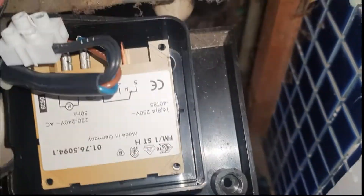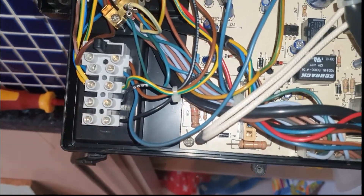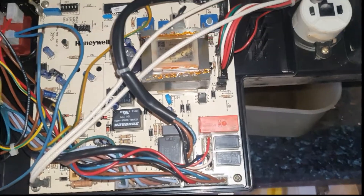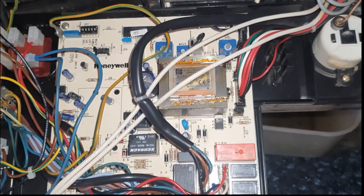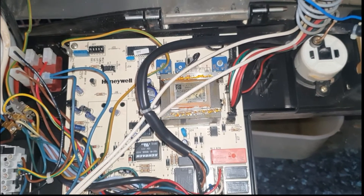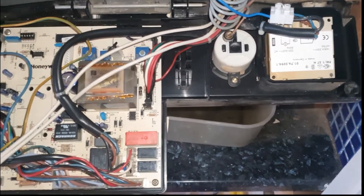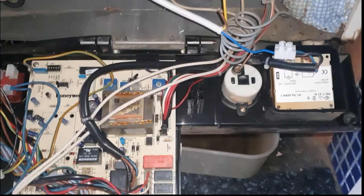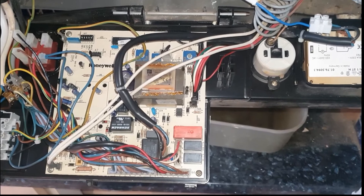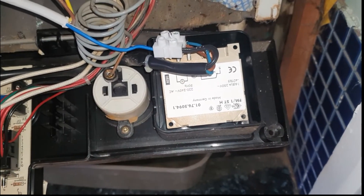Here's a clear picture of the board, and also a clear picture of the old timer — I assume you can bypass it by unplugging and rewiring into here, but I tried that and couldn't get it working. This method is working perfectly fine. There's very little information out there on installing Nest when you don't already have a wall thermostat — all the videos assume you already have one. From my basic electrical knowledge, this is how I wired it and it is working perfectly. It was four cables: neutral, live, earth, and the com switch connection, plus joining the two switching cables together.